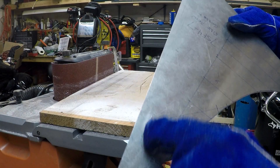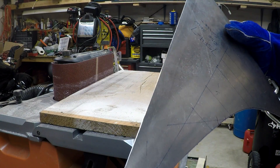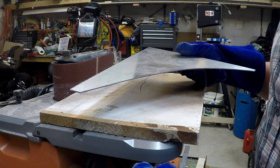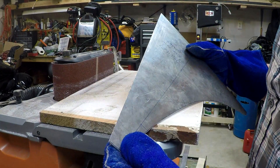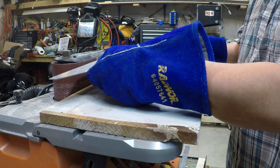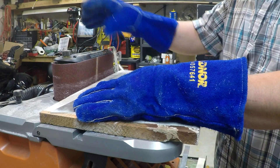I've basically sanded this entire edge right about down to the line. I've left a little bit of the line visible and it's not perfectly straight like straight-edge straight, but it's really darn close - about the best we can do in the home shop setting. You can use a router or hand file these things down, but I found this is about the fastest way to do it while still maintaining good production speed and an acceptable amount of straightness. Drawing it across the belt is what's helping me maintain that straight line because the part isn't hanging out in any one particular spot for very long. Once the belt loads up, I can stack more blocks to get the upper portion of the belt or flip the belt around.